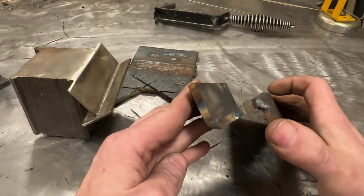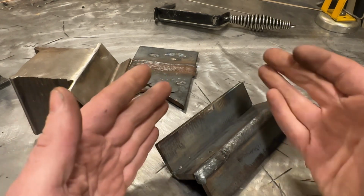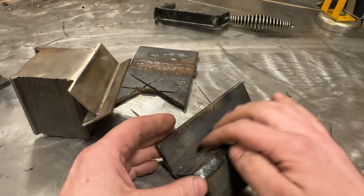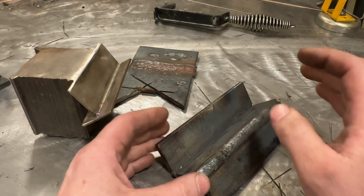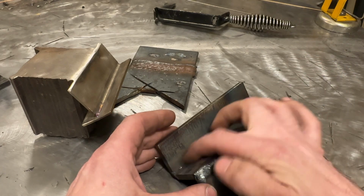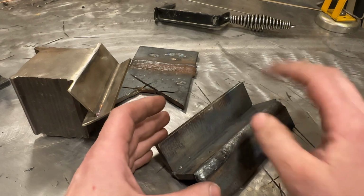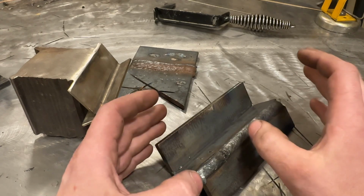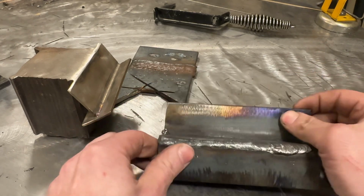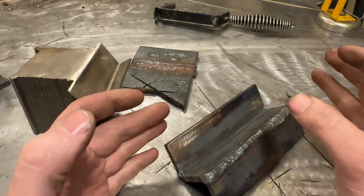So this is a great opportunity to run a ton of rods, which I know we're not making anything yet with this, but the making stuff comes when you know what you're doing with this. So what we're gonna do to start off with is do about 8, 9, 10 passes somewhere in there on this one, and we're gonna start with 3/32 rods, and then I'll flip this. And on this guy, we're going to use 1/8 inch rods,